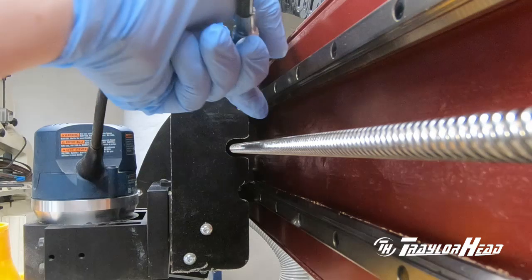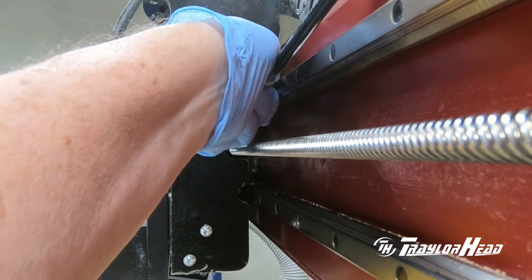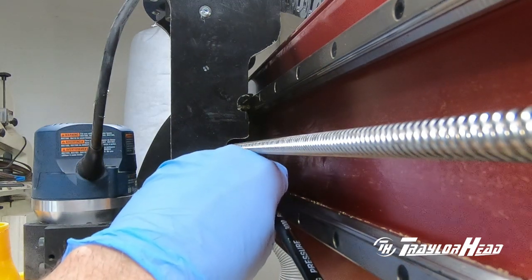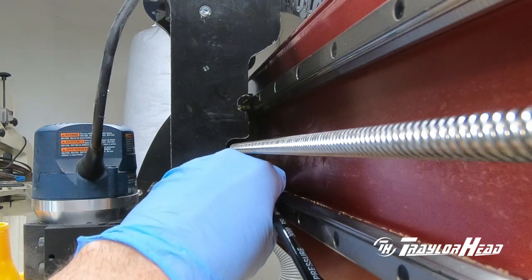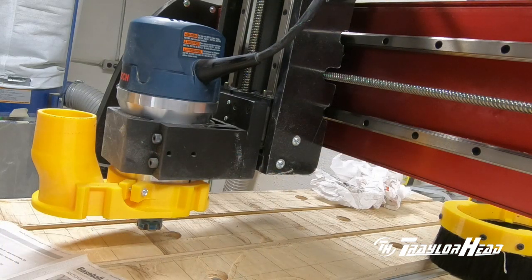This is the reason why I have a flex cable — if I used that hard cable I would not be able to get back here to this. With the slow ball bearing and the tip on this adapter, if you get them lined up you will feel it push in. The recommended greasing interval has been around 30 working hours, and then you need to grease again — we need to get verification on that. But other than that, that's all there is to doing this.